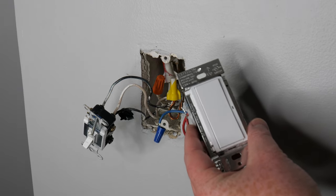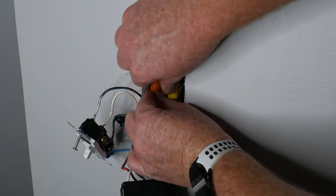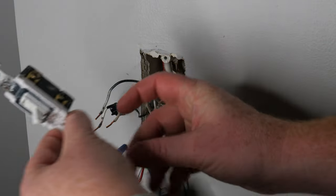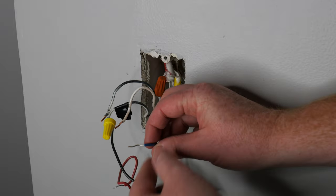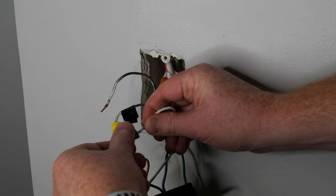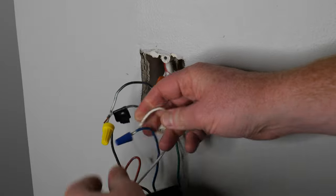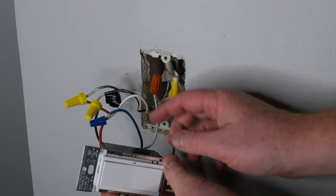There are wiring guides for all of this, but let's go ahead and wire this up with the Claro at location one so we can keep the mechanical switch at the other end. I'm going to place the DVRF5NS at location one. First let's connect the ground, then we need the neutral wire. On the old switch, find the wire attached to the black — that hot wire attaches to the black on the Claro as well. Then we take the blue and attach it to the off-color traveler wire. Here it's going to be white, and then we take the red and attach it to the black.